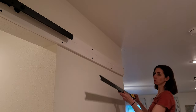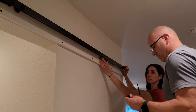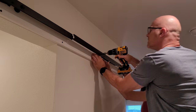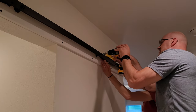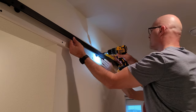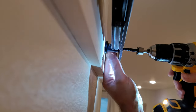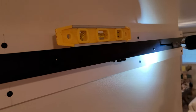With the first half of the rail up, I was feeling pretty good — it was coming along, no mistakes, level, no wood splitting. Two hands help to keep the rail level. The spacer goes behind, lined up, and then get that lag bolt in there. Then screw in all of the screws that come with the hardware. Here's a close-up so you can see how to line up — once you get it set in there, keep it level and drill straight through.